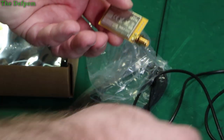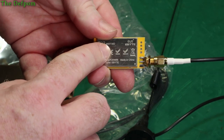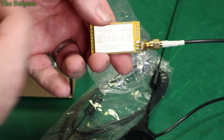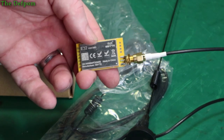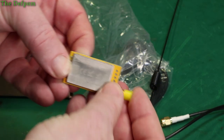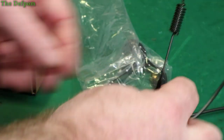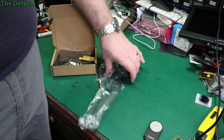Here's one — another wireless unit, so that should plug on there. There are some more 868T30Ds. These are one watt versions. What I've actually been doing with these is programming them not to use full output — I'm reducing the output power in software and running them at the lowest power setting. I'd rather have something powerful running at a very low stress level versus something not so powerful going flat out, just to have the longevity of not stressing things. This one's got a bit of a dent in the casing, which is interesting. Hopefully it doesn't matter as long as they work. I've got a bunch of these now, stocking up on bits and pieces. If I need the extra range or have issues with interference, I could use these instead and stick one on the roof to improve performance.